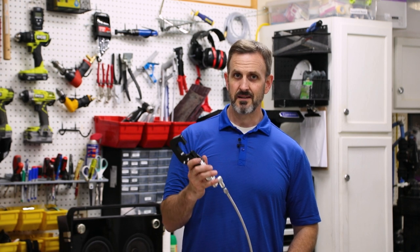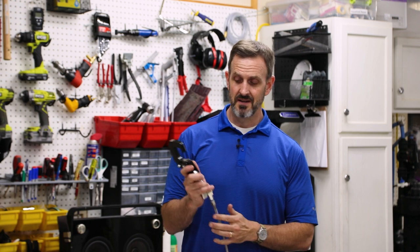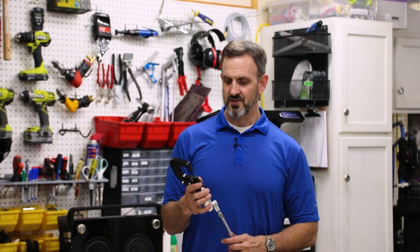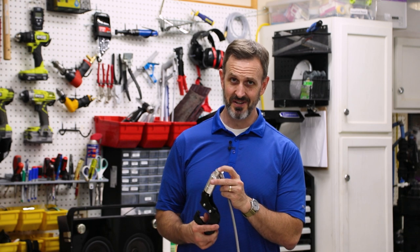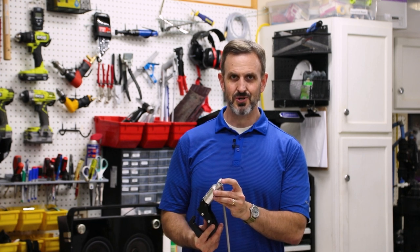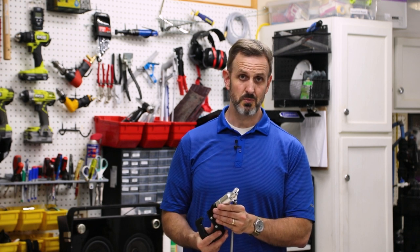I really, really like it. I've looked at videos of people using the other pneumatic squeezers. Never used one myself, but they're pretty dang big. This thing, it's really light, really easy, nice to maneuver. I do have only one complaint about it, and that is this. There's a screw right here in the bottom that if you don't put a ton of Teflon tape on it, it'll start to come loose and unscrew as you go. In fact, I have a video of it, and I'm not sure if I'll put it in, but it starts to unscrew and leak. I've noticed that before and talked to them, and they said put more Teflon tape on.